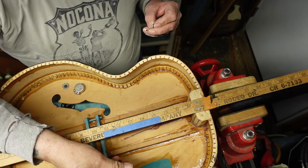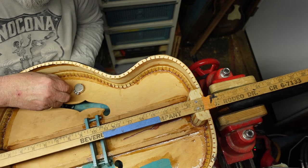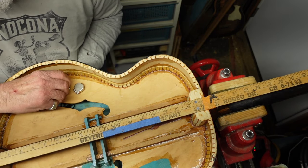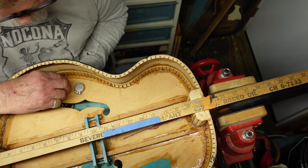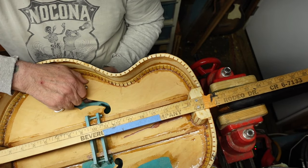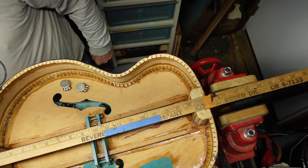So we're going to take the tone pot here. We're going to stick it through the hole. Remember, we have that tooth washer there. And we are just going to put a washer and a nut on this to keep it stable while we're soldering. We have some things called helping hands and the like, but we're just going to snug this up. Alrighty, they are both on there enough and snug enough where I can still move them around if I need to. But we have volume and tone.